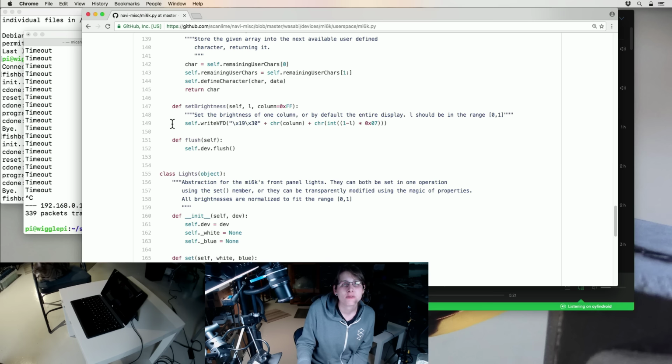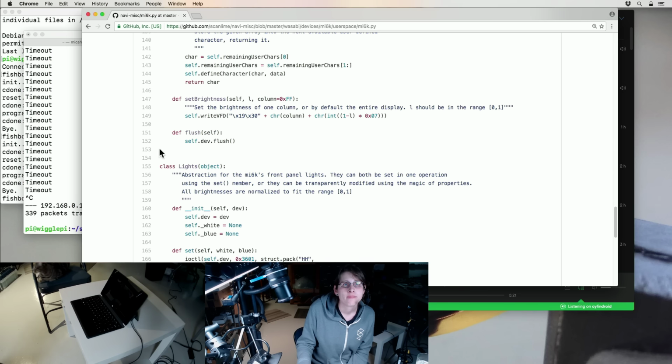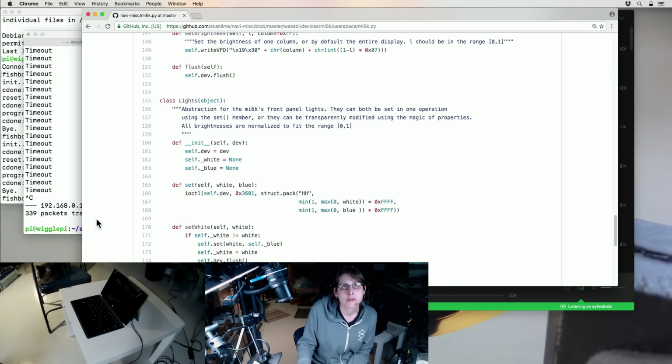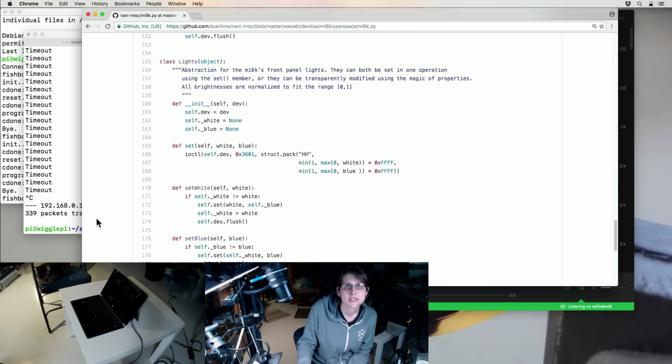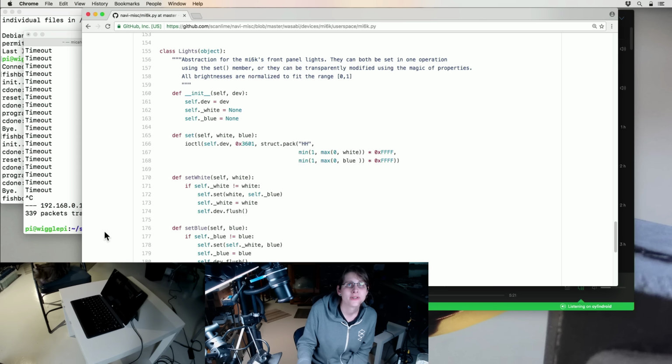Oh, so the VFD has its own brightness control. I remember it not being super sensitive. I think at the time I was concerned with saving the life of the tube by turning off the heater, as well as keeping the display dark sometimes when I'm not using it. I don't actually know how much the heater contributes to the tube aging, but I figured it was probably a good idea to turn it off. But maybe thermal cycling isn't so good for it either, you know.